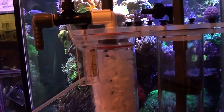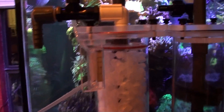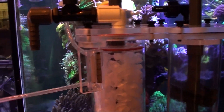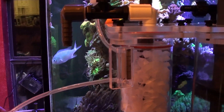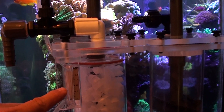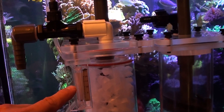This is the ozone reactor on the left. I'll just walk through the workings of it. Here you can see there's a little air meter. This silicone tubing comes in and as the flow is going through here, this ball will raise so you can tell how many cubic feet per minute of air is flowing through the reactor.